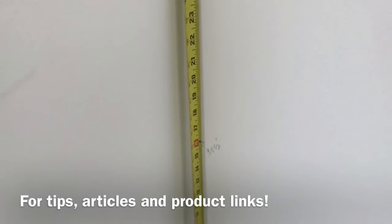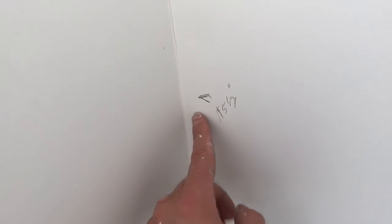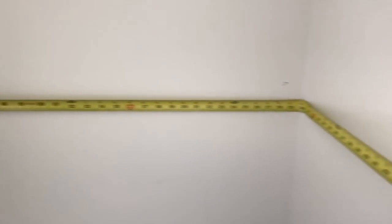When all that's drying, I head inside and begin laying out measurements for where the shelves are going to sit. I want them at about 16 inches and about 32 inches. I'm sitting a half-inch shy of that even though our material is three-quarters. I mark where the cleats are actually going to sit, not the shelves themselves. Then I do the same at the front of the closet and in the four corners on the other side. These are kind of reference marks.